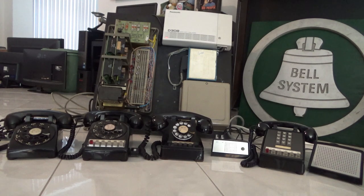The next set to the right is a 565 six-button key set with a buzzer for intercom — intercom number one. I'll show you how that works during the intercom demo. It has four lines plus intercom on the fifth line. Lines one through four are extensions 21, 22, 23, and 24 respectively, as they are on the other multi-line sets. That's the 565, the second phone from the left.